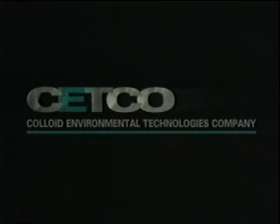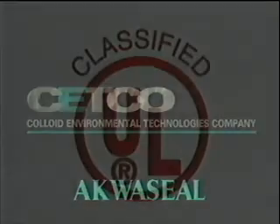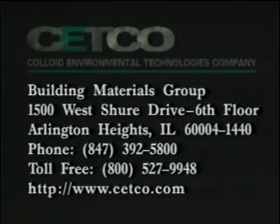As you have seen, AquaSeal is well suited for concrete repair jobs. Being a hydrophobic polyurethane product, it repels water and seals up cracks and joints much better than other grouts. Once it's set, it will not shrink even if its environment becomes totally dry. After you are familiar with the procedure for using AquaSeal for crack repair, a new and lucrative market will be open to you. This product is extremely durable, yet environmentally friendly. AquaSeal is UL listed for drinking water contact under NSF specification 61-1989. Colloid Environmental Technologies Company — your source for quality polyurethane grout, bentonite waterproofing, and other innovative environmental products.